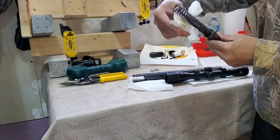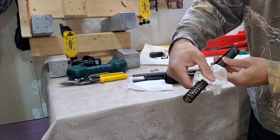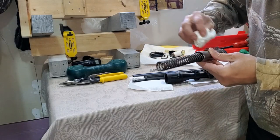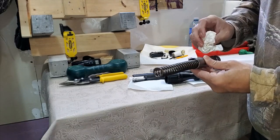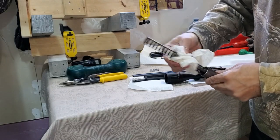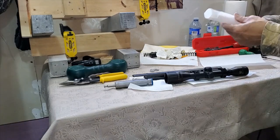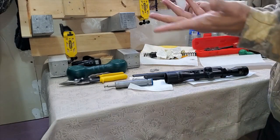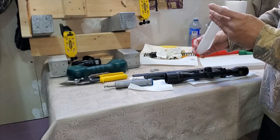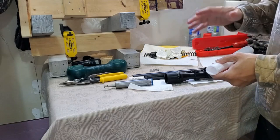I put the spring inside and you can see there is a lot of space around this spring — and this is where the spring can vibrate, which will affect the aim and accuracy of the rifle. So you need to fill this space using a sleeve. The best material for that is a PTFE sheet. I ordered this from eBay — it took a while to arrive but I had already planned everything beforehand.